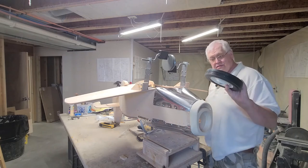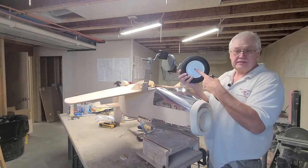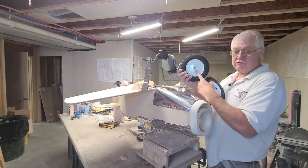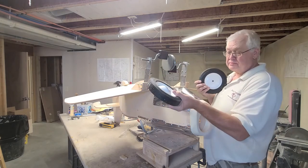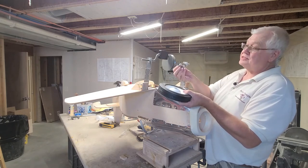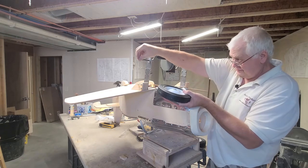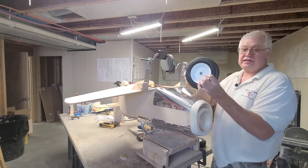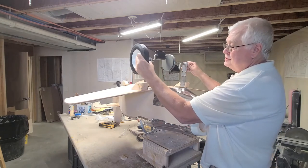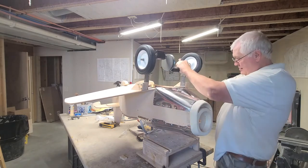Now you have two wheels. One a regular wheel, and the other wheel already has your nut welded in to the drive wheel. This wheel with the nut in it is your drive wheel. You have to have one drive wheel. The free spinning wheel has to go on the left side. You have two little spacers. You put those on the outside of your bearing, just like that. Take your free spinning wheel with the round towards the bearing. Same thing on this side, round towards the bearing.